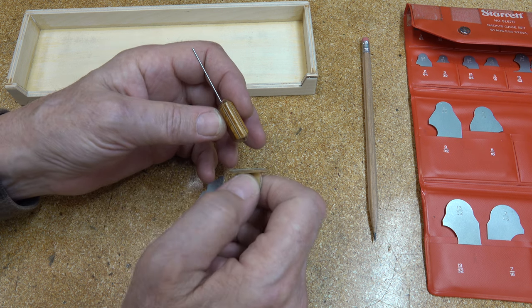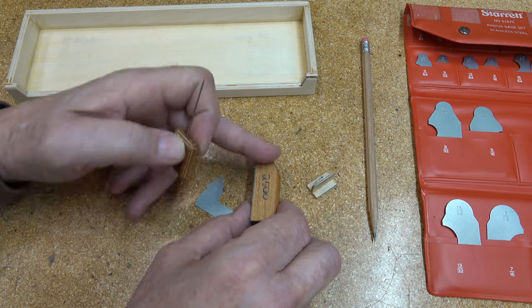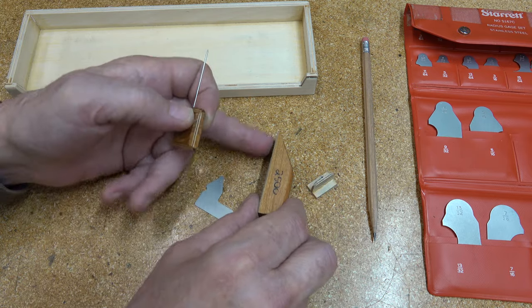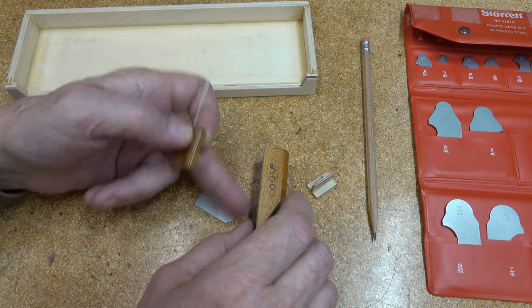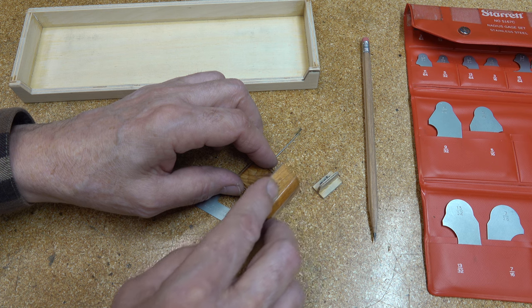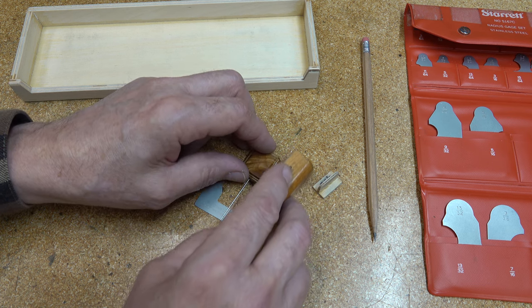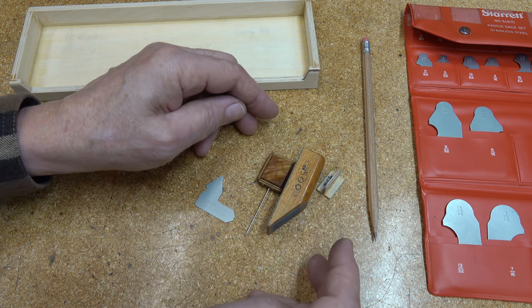The next thing I wanted to mention is taking your sanding blocks and having them so that all sanding blocks have a perfectly 90 degree side versus bottom. So when you have to do things that are in need of a real perfect edge, it's so easy to do that.